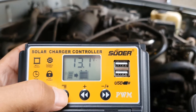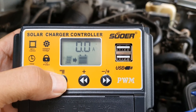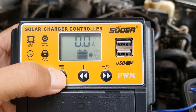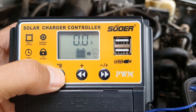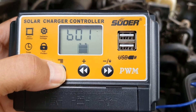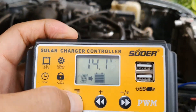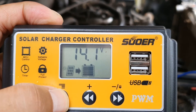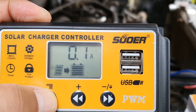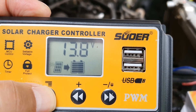As opposed to earlier where there was nothing — the battery is pretty much on float. I'll have to drain the battery a little bit. You'll see me put a load on and start testing with the USB, and it'll go to 14-point-something volts. It's charging at 14.2 volts because I had to use some of the stored charge to verify it was actually working.